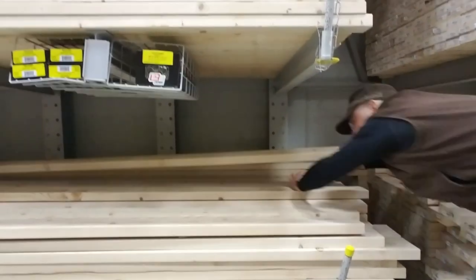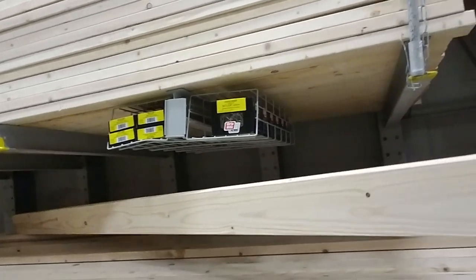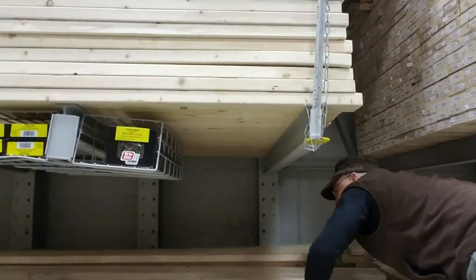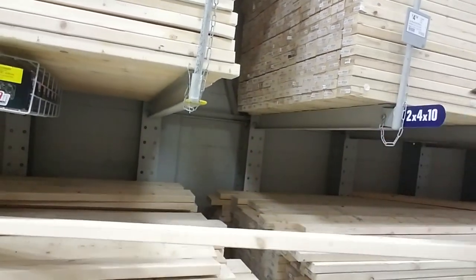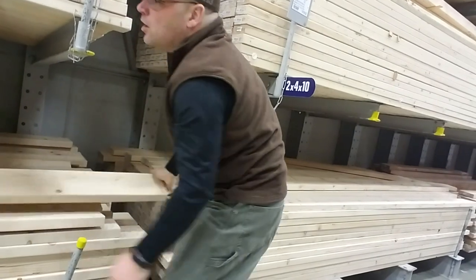Get some really straight pieces. We're going to go with two by six. This one's a good one up here. So what I'm checking is what's called the crown. I'm looking down the top of the board to make sure it's straight and it doesn't have much bow to it. And there we go. There's another box here. A piece of one by between these two — two good ones.